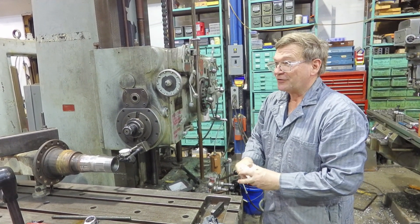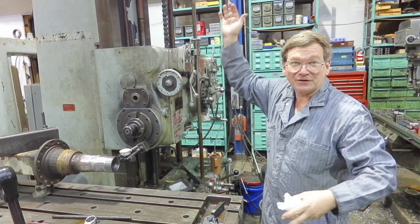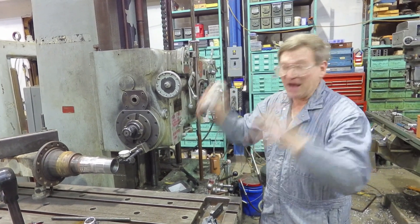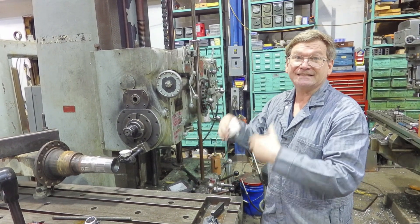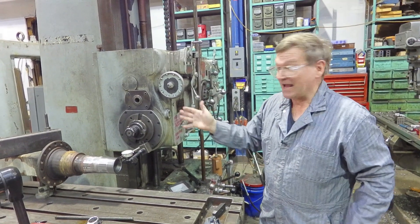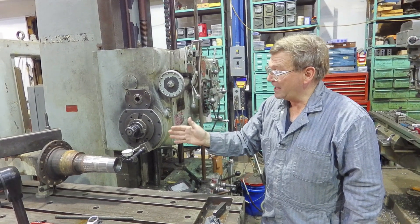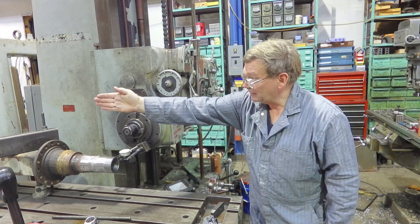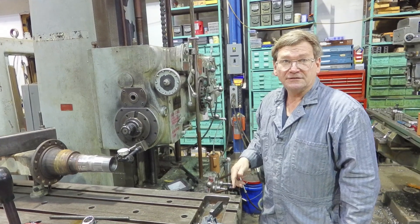They don't figure on this really staying as a rigid piece. If it were an off-road super mudder with rock tires going to jump over cars, we'd make it straight and super strong. But in the real world, trying to save weight and still haul a lot, they put a little bit of bend in these. The amount varies from axle to axle, but a common amount is — if you had it straight on both sides — about an eighth of an inch to maybe a quarter inch of bend in the middle.